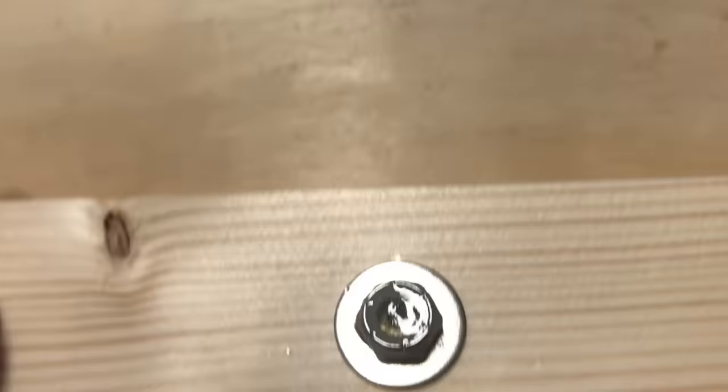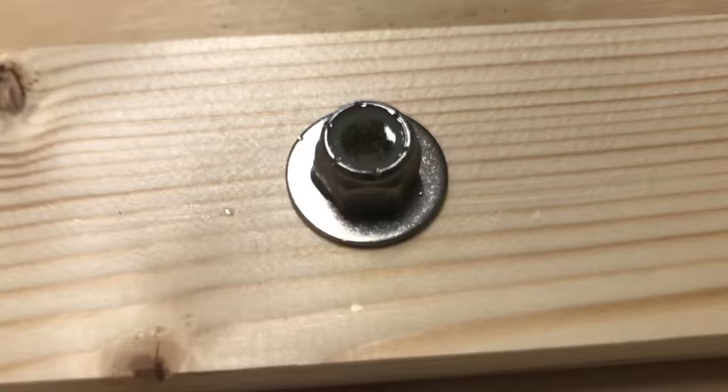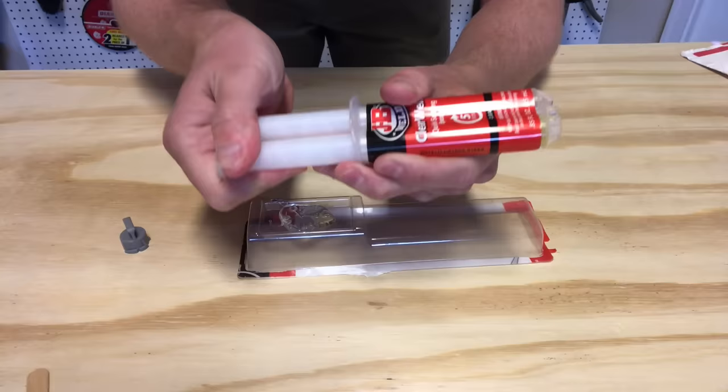What makes it so much more useful than most superglues is that it's thicker, like a gel. This means that it tends to stay put, which is great because it's also a gap filler. It can fill up dead space between components and make a solid bridge with that tensile strength across the gap. This function alone gives it so many applications across so many industries, because most other adhesives just don't do that. And it works on many surfaces: wood to wood, metal to wood, metal to plastic, metal to metal — epoxy locks them all together.